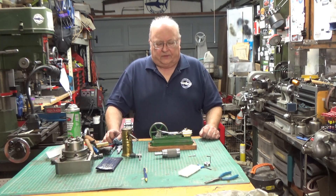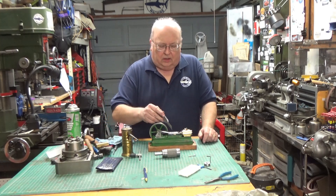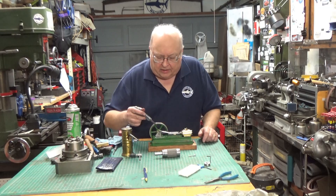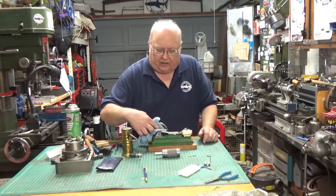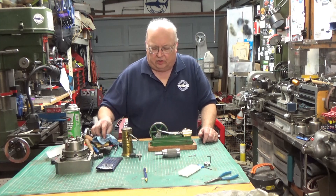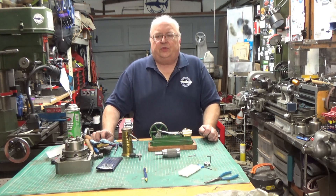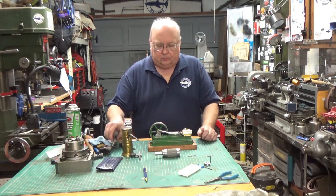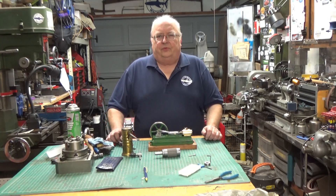Off-camera I pre-drilled four different locations — one each for the slide head and one each for the main bearings. The main bearing holes were already in existence and had been drilled previously; I ended up having to tap them out to 8-32 because of the size they were. The ones on the rails are tapped to 4-40.